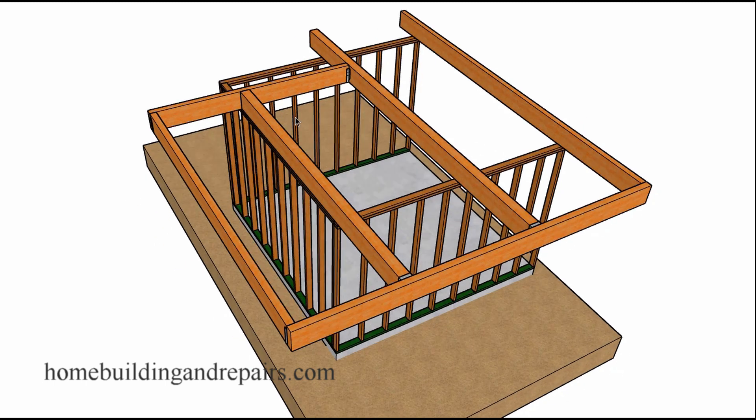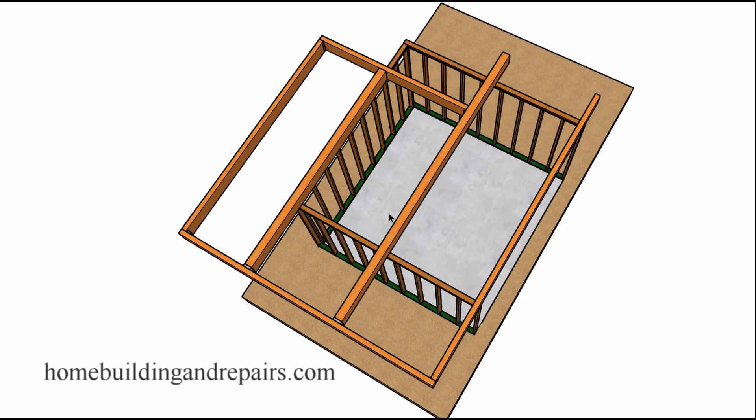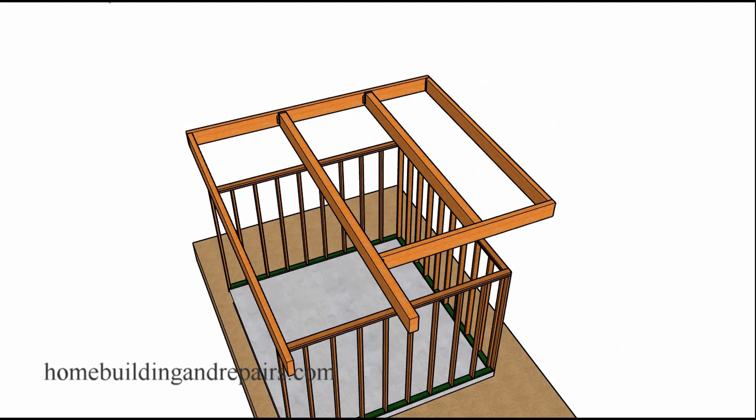You're basically going to use a couple of stronger beams. These are going to need to be a little wider, a little more heavy duty, because they're going to use a hanger that is turned upside down — not the way a hanger is normally used. These two beams here are going to create a beam that can cantilever out and support a beam, and these two beams are going to be the key to this whole operation.